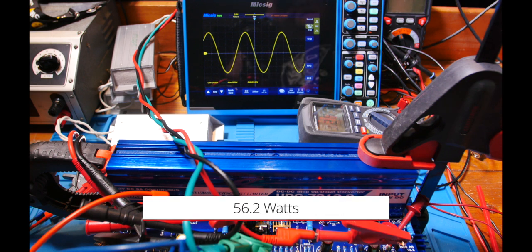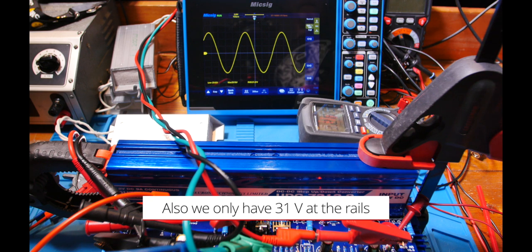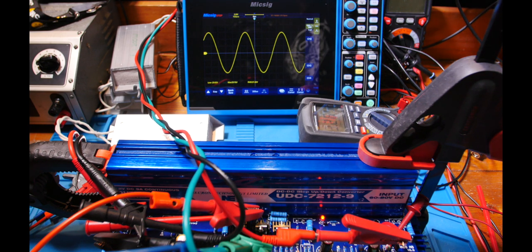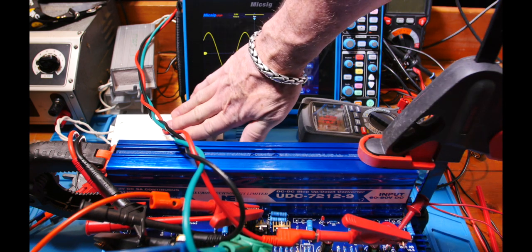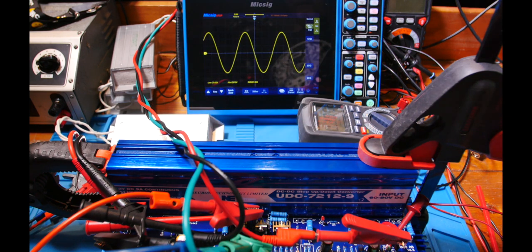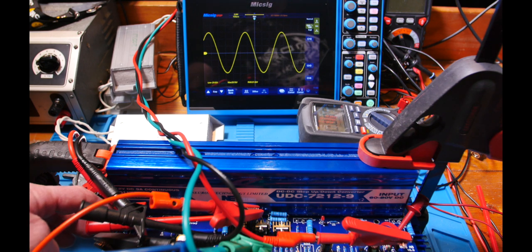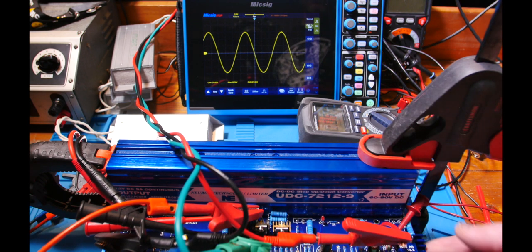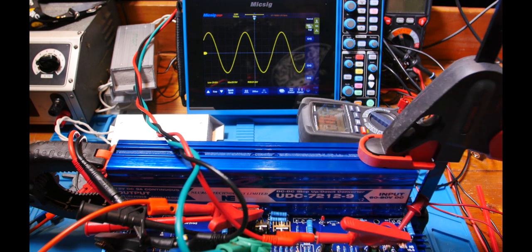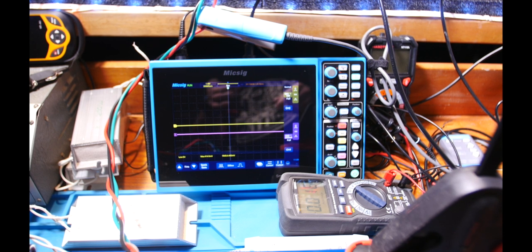It came down a little to about 21.2 volts — things may have heated up slightly. The load resistor wasn't on long enough to get warm. Now that we're putting current out through the load, different resistors are carrying current. I've got four of them stacked up so they should be fine. That was 21.26 volts RMS into 8 ohms. Now I've got another Micsig product — the current probe on the power supply — because I noticed the current limit light was clipping.